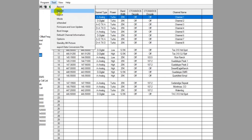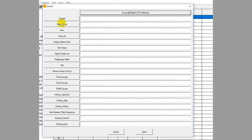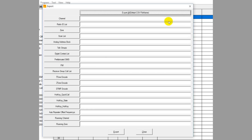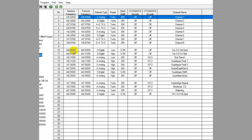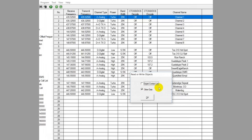There are multiple files you can upload from your computer into the CPS, or Customer Programming Software, or download to your computer independently. This just brings them into the software. Note there is an option to export everything and have them in a list so that you can read them in all at once. Note this refers to uploading and downloading between your computer's file system and the CPS software. You can upload to the radio from there, but for that you have only two choices: digital contact list or other data. The digital contact list is on this list, but all other files are lumped into other data for upload to the radio.